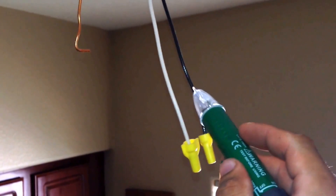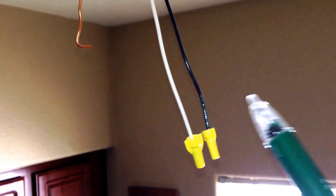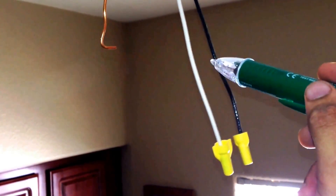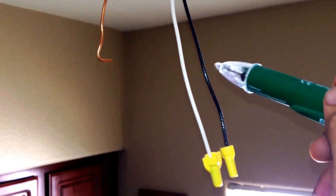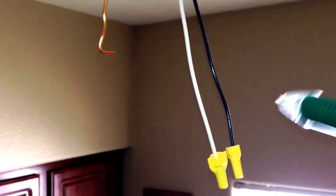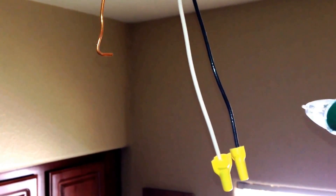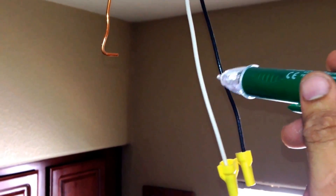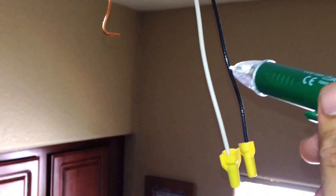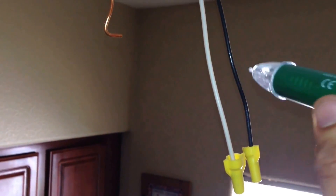Whenever you're working with exposed wire you'll follow the same procedure. If you tap it here it should give you a reading. Right now I have the switch off and I'll turn it on right now. You always want to — whenever you're working with exposed wiring and you turn off the breaker or you turn off the switch — always test it before you work on it. You never know if they hot-wired it or if something else was done without your knowledge.